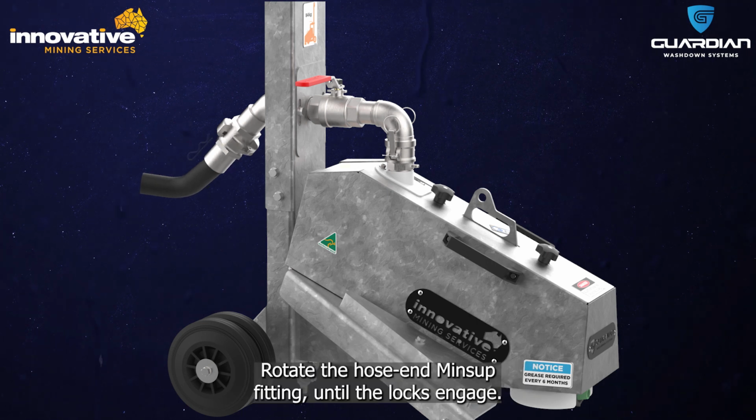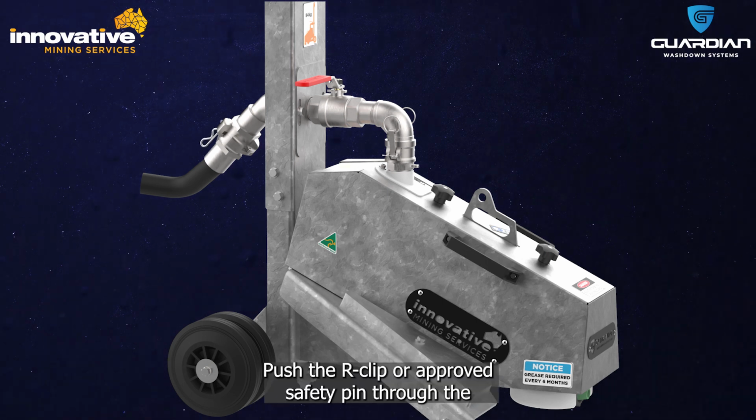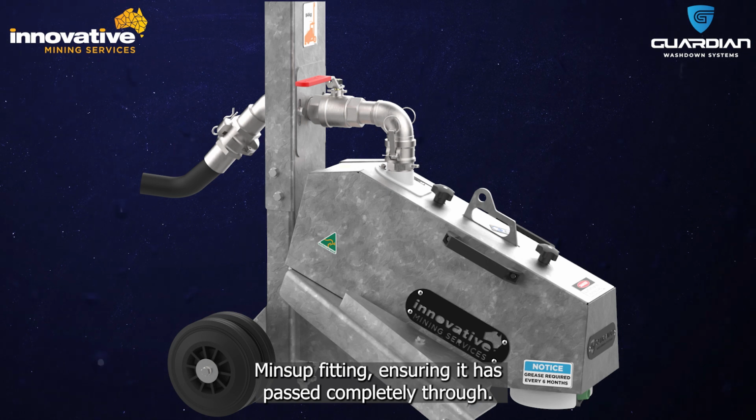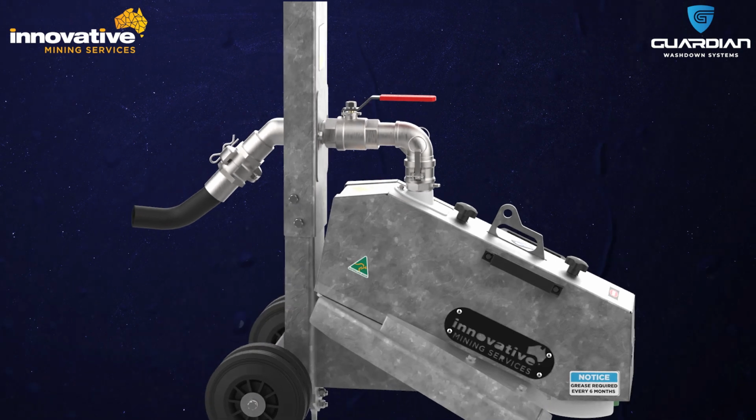Rotate the hose end min-sup fitting until the locks engage. Push the R-clip or approved safety pin through the min-sup fitting, ensuring it has passed completely through. Open the ball valve to commence the washdown.